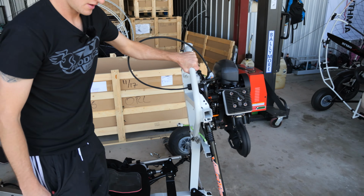And also you see the reserve bridle here. Make sure this is not tucked inside when you Velcro this on. So we're gonna move this out of our way, put this straight up and down, and we're going to Velcro this right on here. And then we'll tuck the remaining excess into the back pocket. For your extra pieces of the reserve, we are going to run this here and connect this appropriately. Now nothing is in our way and it keeps all of our extra reserve bridle nice and secure.